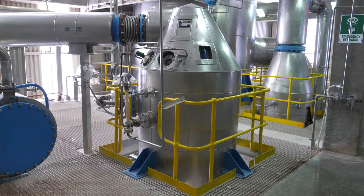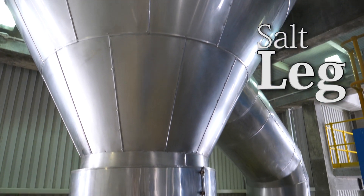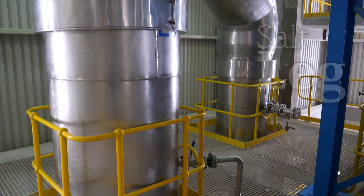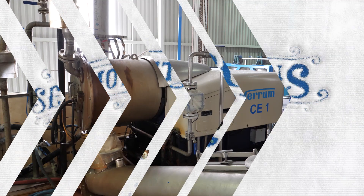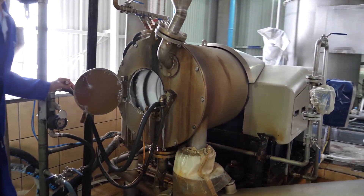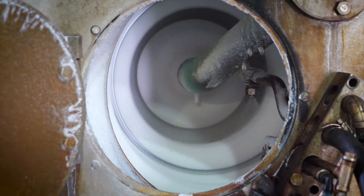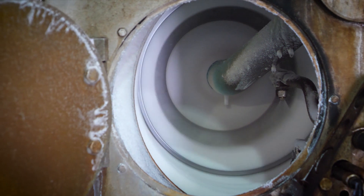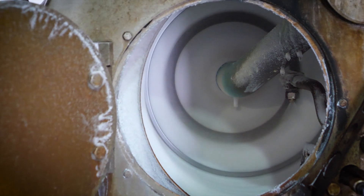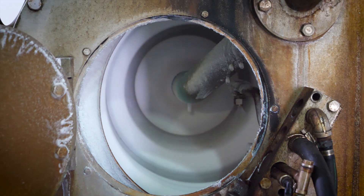As the brine oversaturates, salt crystals begin to form in the evaporator. Once those salt crystals reach a particular size, they will have enough gravimetric mass to drop into what's known as a salt leg at the bottom of the machine as a 50% water and 50% salt slurry. The salt slurry is pumped into a centrifuge where a further dewatering process takes place and the remainder of the water is removed. As the inside of the centrifuge rotates at high speed, the water is flung out and pure salt with a moisture content of about 3% remains. So the centrifuge takes the water content in the slurry down from 30 or 40% to about 3%.